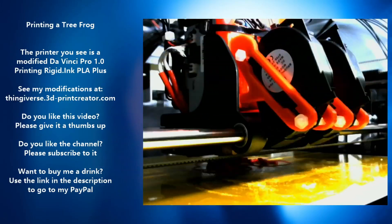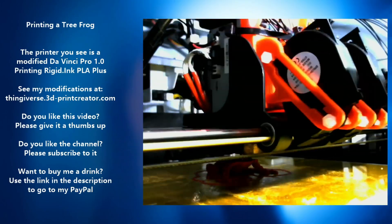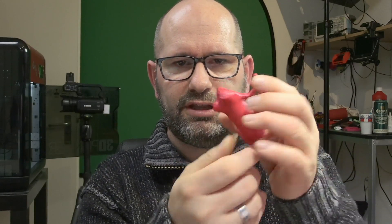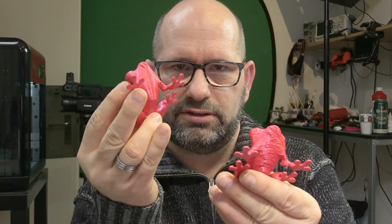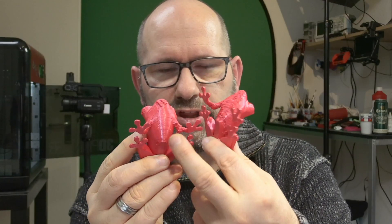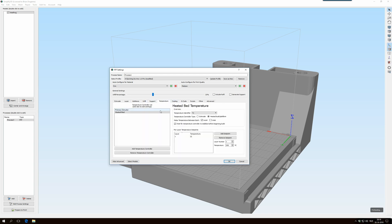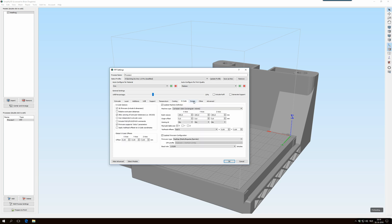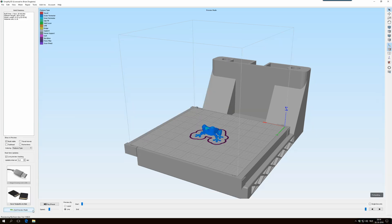Still there was something that wasn't very nice and I wasn't happy with it, so I printed some bigger tree frogs. This one even has some holes in its head. I printed it a brother, and the brother had the same problem — although this one had a smoother finish. The only thing changed was going from 230 degrees Celsius to 220 degrees Celsius, and both were printed at 25 millimeters per second with a cooling fan running.